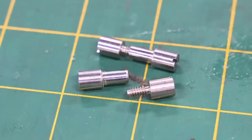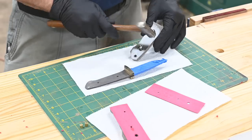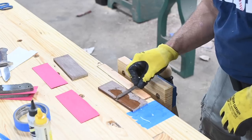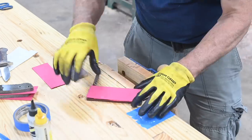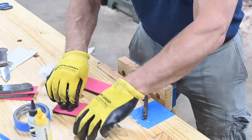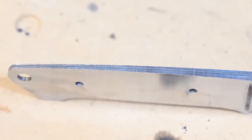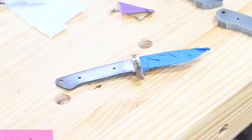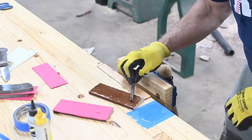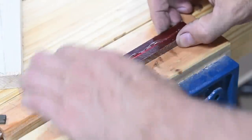In the second knife, I'll use Corby fasteners. I personally like Corby fasteners much better than Loveless bolts. In one knife I assembled everything at once, while in the other I glued the fiber to the scales beforehand, which made the final glue-up a little bit simpler — I prefer the latter approach. I ground a very slight angle in the face of the micarta, exactly matching the angle of the tang taper, which allows you to get a perfect mating to the back face of the guard. Then I cleaned up the micarta and fiber spacers with acetone, scuffed them up with heavy grit sandpaper, and blew everything off with compressed air. Meticulous preparation like this will keep things from delaminating later on, which is a disaster.